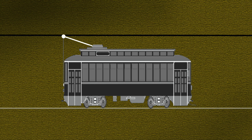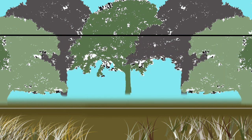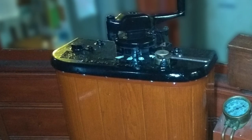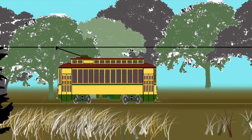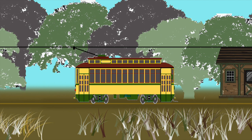If all of the voltage in the trolley wire was sent directly to the motors all at once, the streetcar would jump ahead suddenly and very quickly. That would be hard on the motors and gears, to say nothing of what it would do to the passengers. So the controller needs to send a very small amount of current to the motors so they start turning slowly, then increase electricity gradually to allow the streetcar to go faster. The controller accomplishes this in a variety of ways.